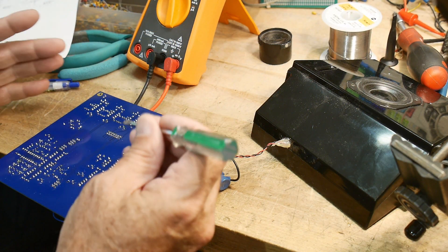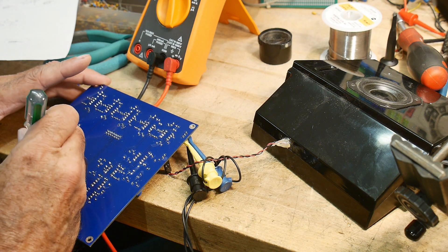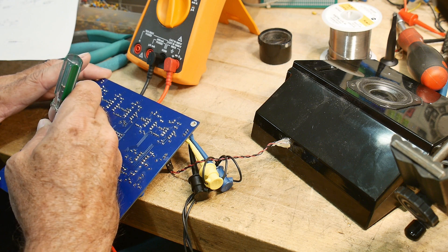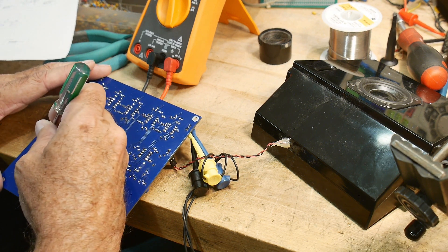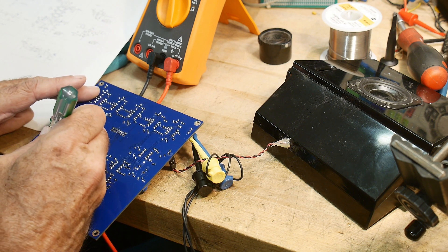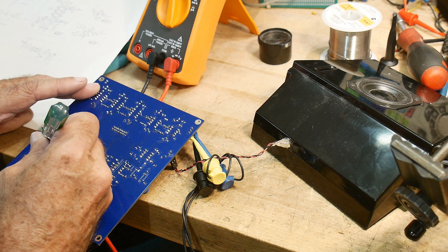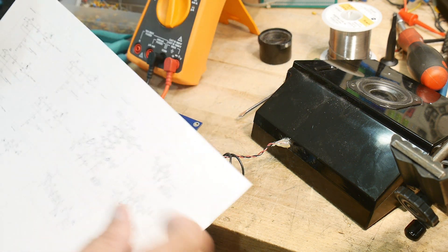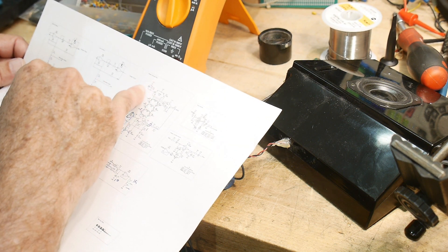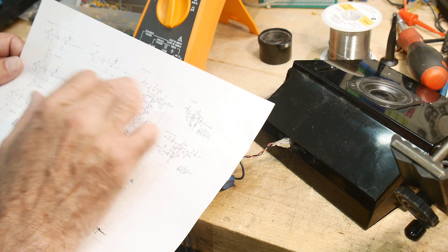All right, I found it - found the pin. I have to isolate where touching is best and try to figure out why - some component value or a little bit of feedback somewhere. That is the biasing of the first differential pair. I remember my last filter was a bit susceptible to what values you put there - there's a pull-up. I need to take a look at those - I'll remove those values and we can play with them.